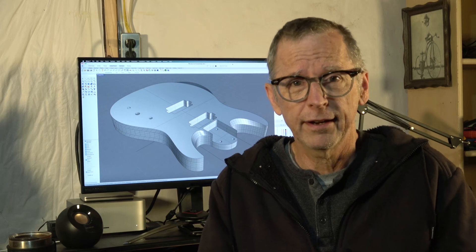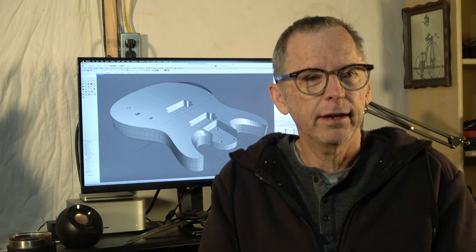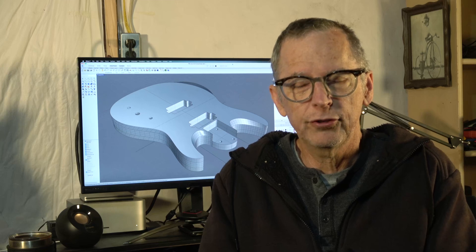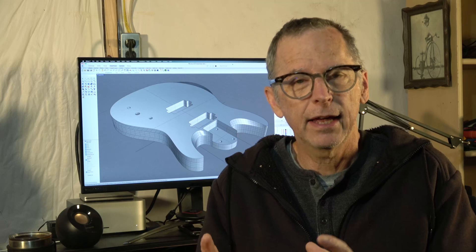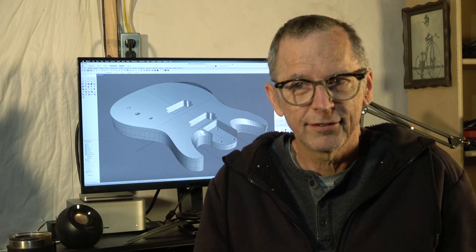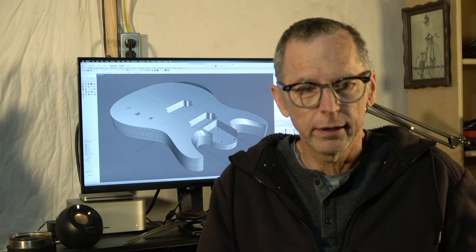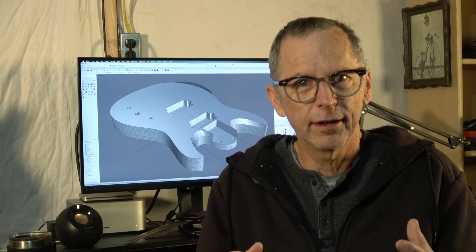When it comes to cutting on the CNC machine, it is dramatically faster. The time it would take to make a neck using traditional techniques could take anywhere from six to eight hours of work. With the CNC machine, it's two hours at tops, and sometimes even faster. What I have once it's finished is a neck that is ready for 220-grit sanding. There's still some handwork involved, but it's far less than when I was using a spokeshave or rasp files to carve the neck contour.